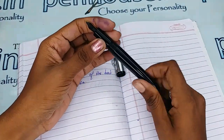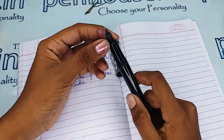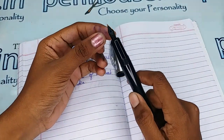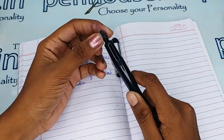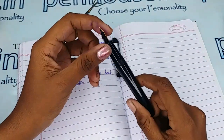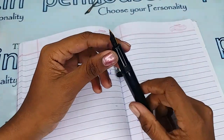On pen maintenance, please wash the pens regularly — that is twice a month — because all dye-based inks like Penhouse ink, Brill, Diamine, and others will precipitate with longer usage, so you will get scratchy writing. Slowly the ink will dry quickly and then you may have to shake the pen for the ink flow to come out.